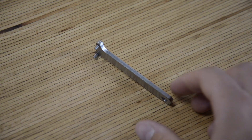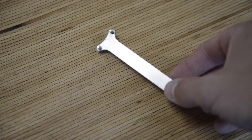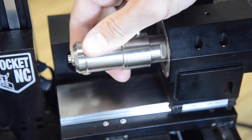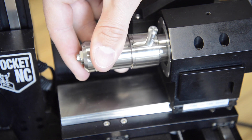Now there are a few things to know when using this trick. One, we don't recommend using anything but our ER40 collet fixture wrench to loosen the collet, so if you don't have one, please contact us so we can get you one. Two, never slide the spindle out more than half an inch or to the end of the wrench flats. Three, after you have tightened everything back down, make sure that the spindle lever points up when in the locked position.